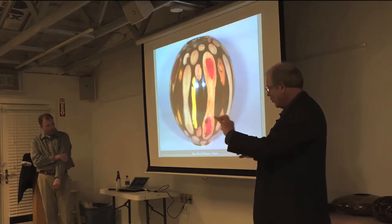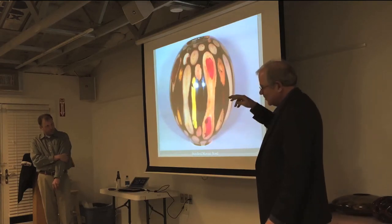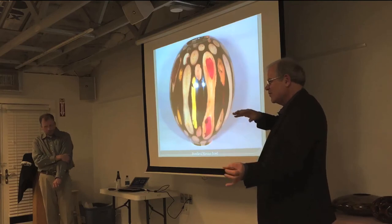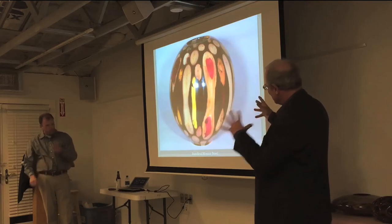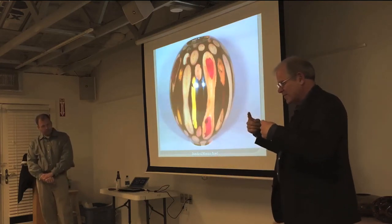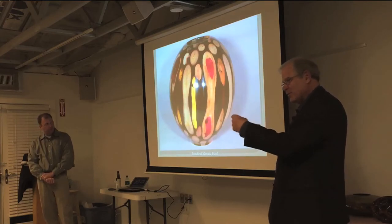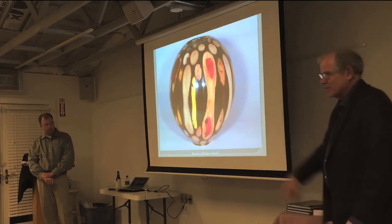It's very tight. And then I pour this resin in here, and it's darkened with carbon black, because carbon black is a color that actually appears in nature, but it doesn't compete with wood color. If you use a brown mixture, you take away from all the other wood in here. So the black is just a background to highlight the wood. Once this hardens, I pull the form off and I have this solid cylinder, and I treat it just like it's a log. It goes on the face plate, and I shape the whole outside and hollow the inside out, and end up with this.